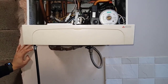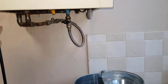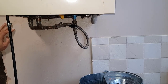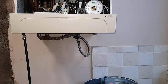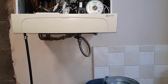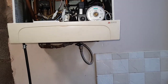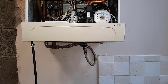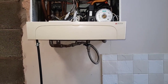Now we're using the foot pump and it's discharging the water out. This is the reason why you use your foot pump — to push out any trapped water in the boiler. Initially when I opened the drain point, no water came out; it seemed like there was nothing there. But now we pump air into the expansion vessel and you can see how that water gets displaced because it was trapped or air-locked inside.